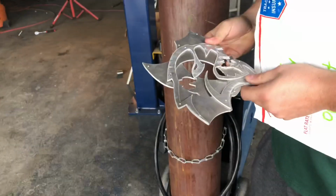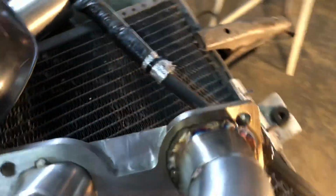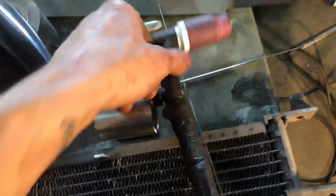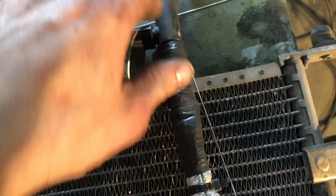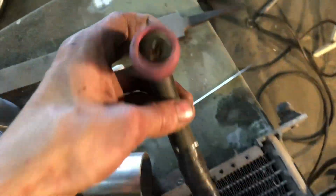Hell yeah. Very cool. So here's the driver's side header all tacked up, and I started welding it. Got the back purging set up. I think I've showed you that stuff before. We had to buy a different torch and a different torch power cable, and got this gas stuff going on. I brought my number 12 cups from home with a gas lens. Brought some stuff from Colorado.